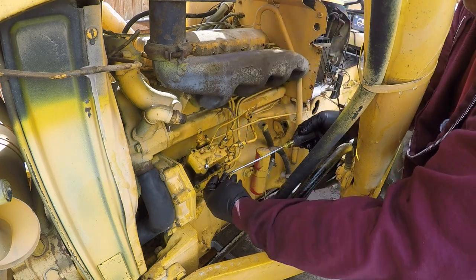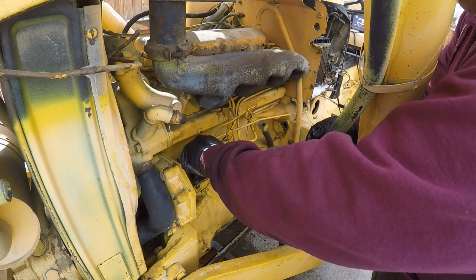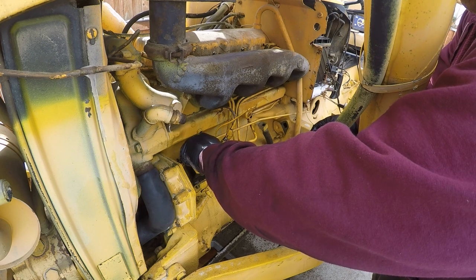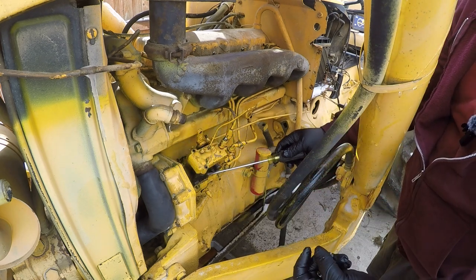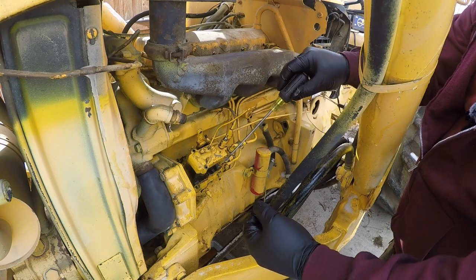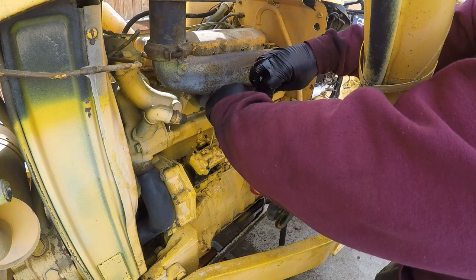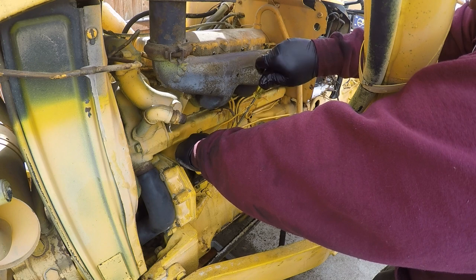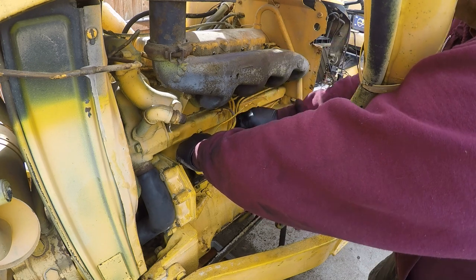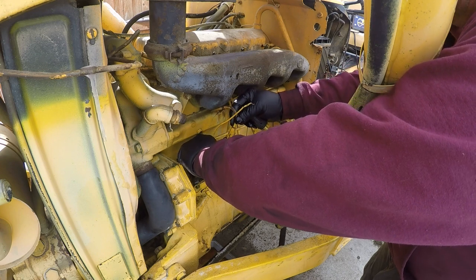By the way, this screw I broke taking the thing apart. I obviously fixed it. There was a little bit of stud left over on that screw, and I just simply welded a nut to that and pulled the stud right out. That's why the housing is a little black right here, because I heated the whole thing with a torch first to warm up the whole body before I took that nut out.